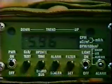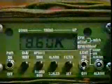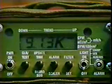When you prepare the meter for alpha monitoring or survey, turn the power on and observe the background reading. Position the arrow to the choice of units desired for the alpha monitoring operation. Select and set the operating features for the alpha probe. With power on and feature set, remove the access cover. Centrally locate the test sample between the probe mounting feet with the alpha side facing the mylar window. The display should read between 7,000 and 14,000 counts per minute. Remove and replace the test sample in the case. Monitoring is normally performed with the alpha probe within one-eighth inch or directly on the surface being monitored. Sweep the surface in a stop-go fashion, allowing time for detection reaction and display.